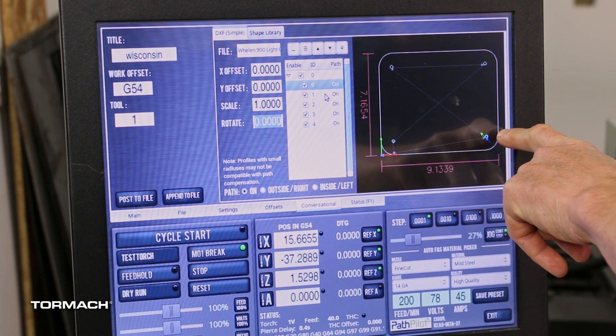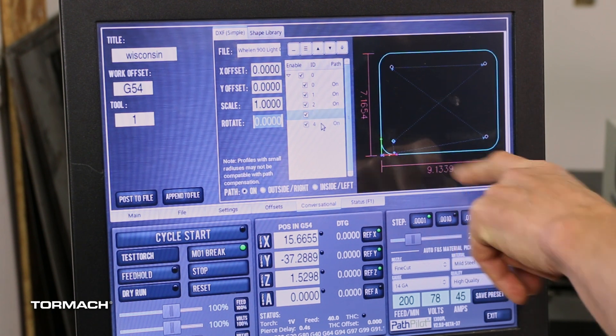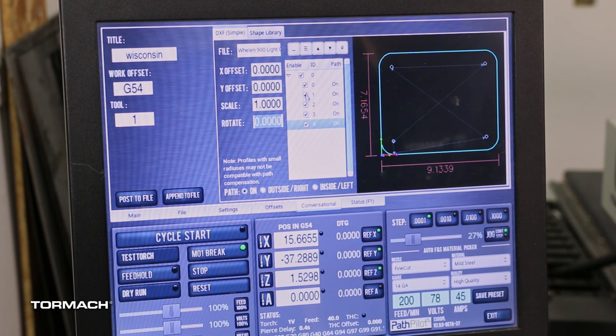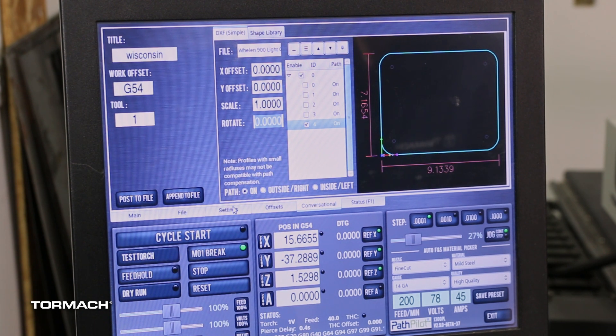By highlighting them, you can see what they are. As I highlighted that, it's that lower right hole, upper right hole. And using these checkboxes, I can turn these on or off. So if I didn't want these holes, I could just unselect them and all I have left is the outer shape. You can apply kerf compensation either to the outside of this shape — and here you'll see I do have a tool diameter entered. The purple is telling me the actual cut is going to be just outside of the shape. Or you can apply it to the inside.